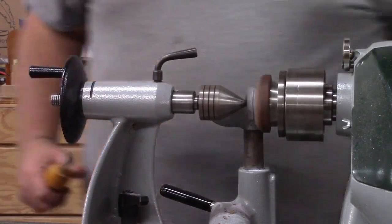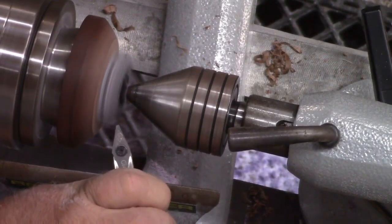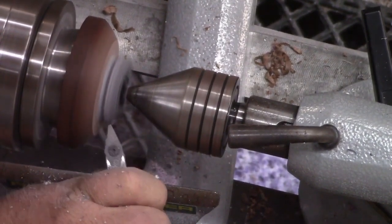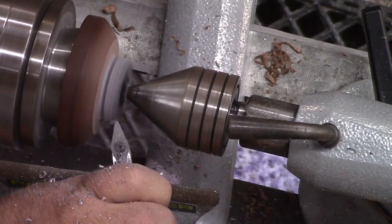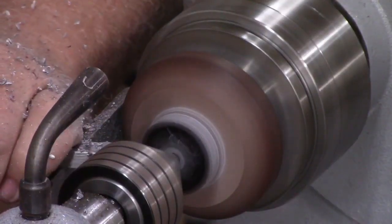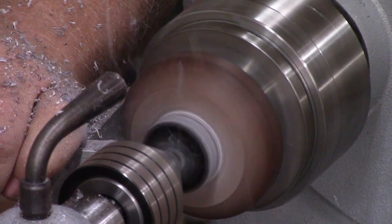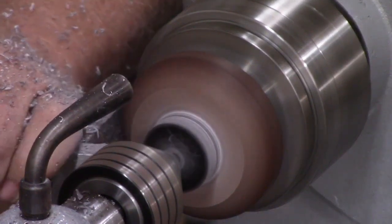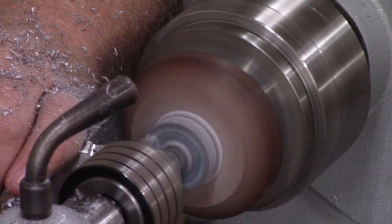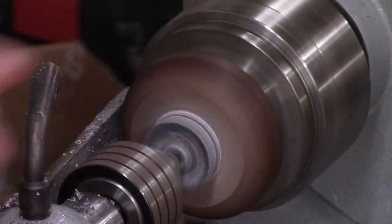While it's glued up with the tailstock in place, I like to do a little turning — face off the blank, because Fordite is unusual and rarely straight. This had an angle to it, so I like to round the blank and face off the front. Using the tailstock gives a little more support and is easier on the Fordite, because it can literally peel apart at the layers. With Easy Wood Tools the carbide just cuts the paint like nothing else, so it's super easy.